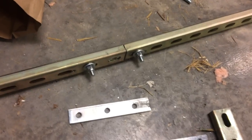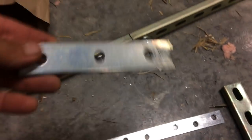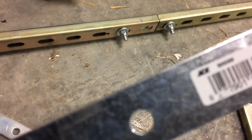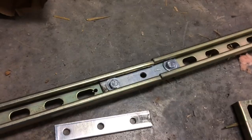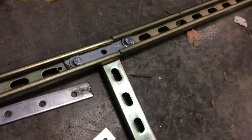I just want to show you guys what I'm doing to get my unistruts to join together and support them. I went to the hardware store and I bought these pieces of metal to connect other pieces of metal - kind of a bracing bracket, so to speak. Ten-inch mending brace, zinc, made in China. I got those, I'm cutting them in half so I can double up. They were like four dollars and sixty cents a piece. I'm sliding it right in between there right where the break is and I'm bolting it on either side. Pretty nice and rigid - I think it'll hold just fine. I'm also going to put a piece right in between going perpendicular to the racking that's going to be going horizontal against the roof.